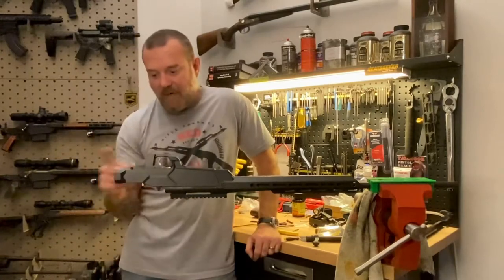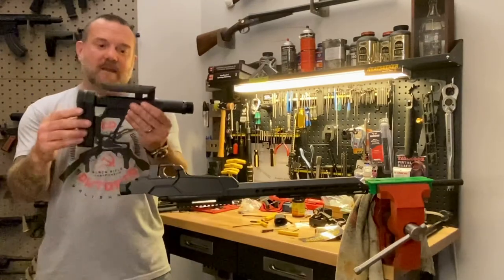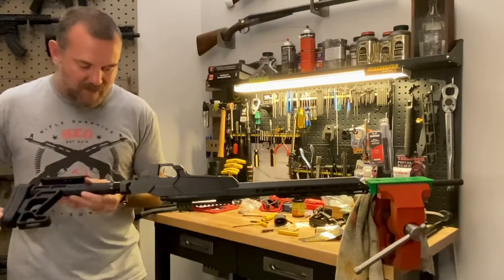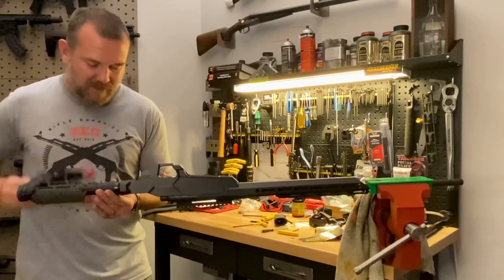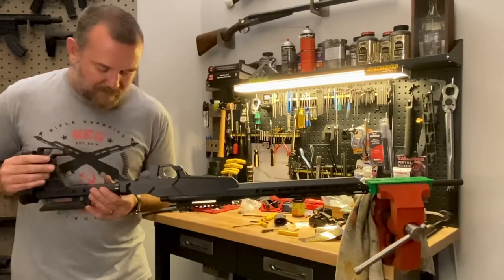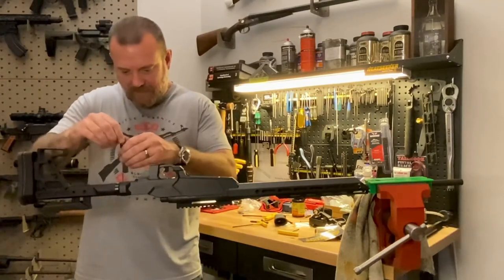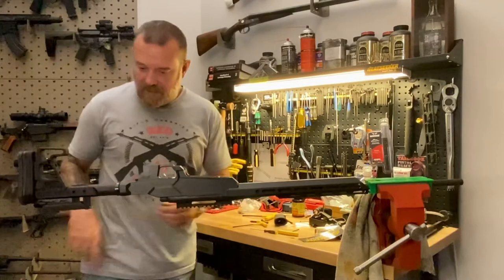The only thing left is to add a grip and then an AR stock of your choice. I always start with the stock first and I recommend you do as well. In this case today I've got a Rival Arms stock. It's a pretty low-cost aluminum-based stock with a nice Limb Saver on the back and an adjustable cheek piece. It threads in like a standard AR-15 stock — same buffer extension thread. Then inside the bag of parts we have a little set screw which goes in here, and this is why I recommend doing the stock first before the grip, so you have access to that set screw. That will help keep this aligned up and down.